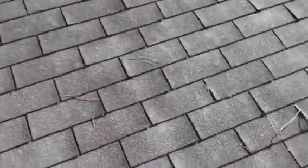That's a bad place to be, especially as we move into these fall months where the wind starts picking up. After the sun's been hitting on these shingles all summer, it makes them more brittle and a lot easier to just snap right off if that wind does get underneath there.